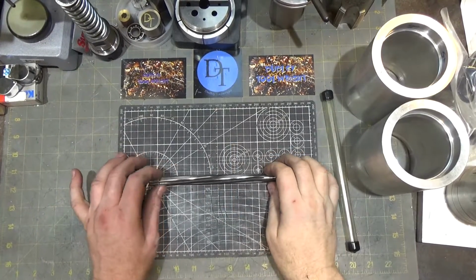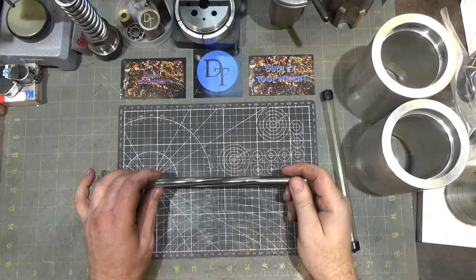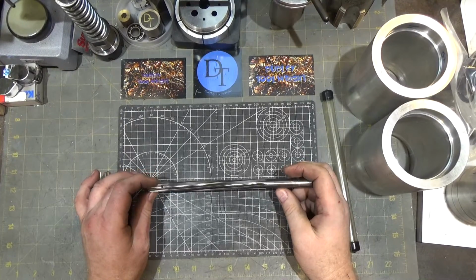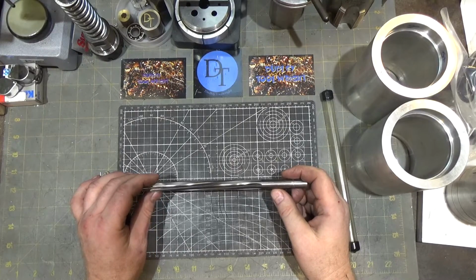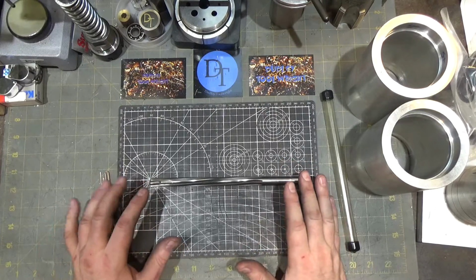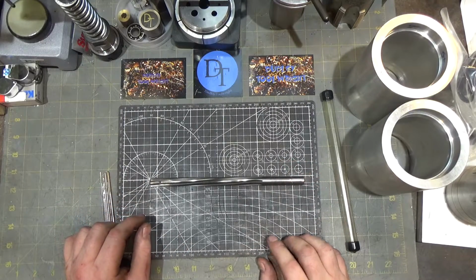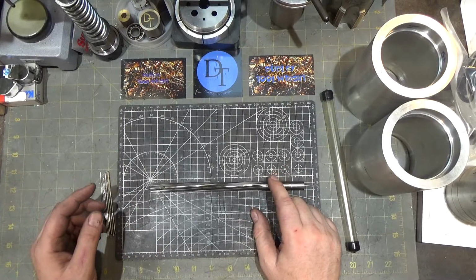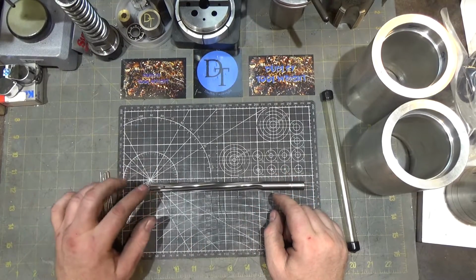All right, so next in the sort of range of extremes, this is a 1/2" reamer, carbide tipped. It's actually 0.502, and I got this in a lot on eBay a while ago. I think I got like 30 of them for 50 bucks, and then I sold a bunch of them because they're all brand new. They're coolant through, pretty fantastic. It's a little bit unusual size.